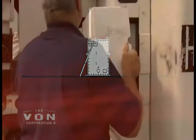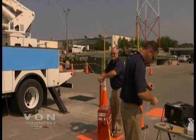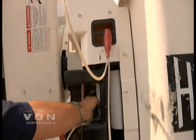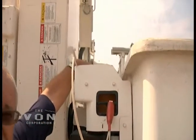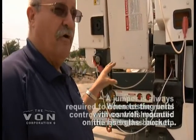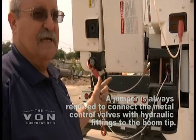We are now going to test the upper boom of this bucket truck. When connecting the upper boom to the high voltage test leads, you need to ensure that you connect all metal components. We connect to all metal parts at the bucket, to the mounting frame, to the hydraulic lines that feed the controls and the tool circuit, to the control handle, and also to the metal where the material handle and jib is. This way the customer is ensured that all metal parts are energized. The boom is energized inside and outside, the hydraulic lines are energized, the hydraulic oil is energized, and it's all tested at one test.